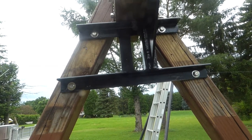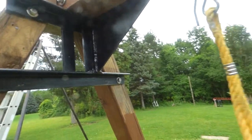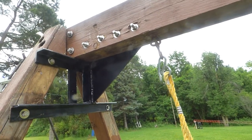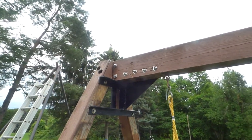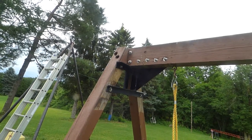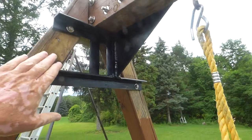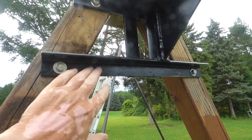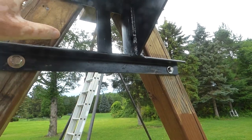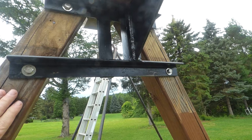Or two nuts. But I welded up this bracket. First I tried it without the gusset. In case you don't know what a gusset is, this is a gusset. It's a structural part that adds a lot of rigidity to a horizontal and a vertical piece. Basically we have the horizontal — by the way, this is a quarter inch, one and a half inch angle. So it's a quarter inch thick, one and a half by one and a half, secured by a bolt on each end through the post.